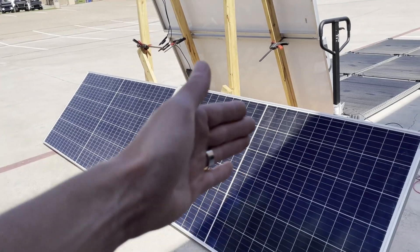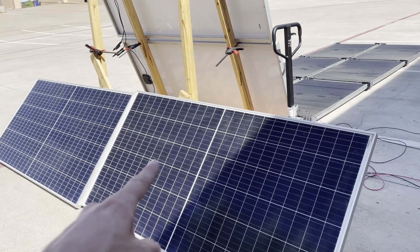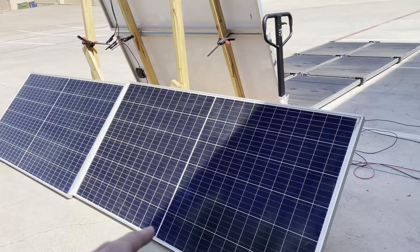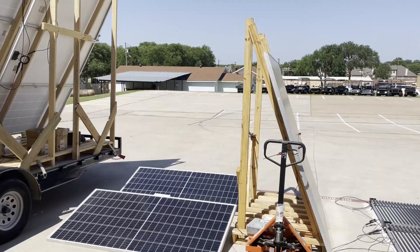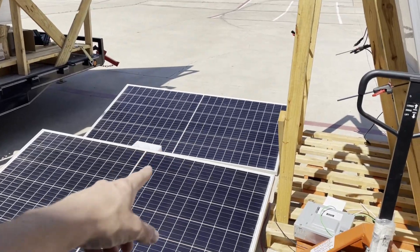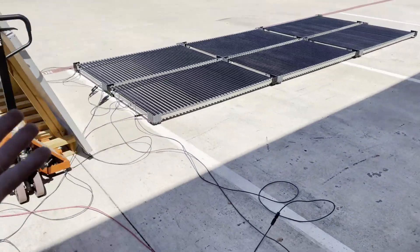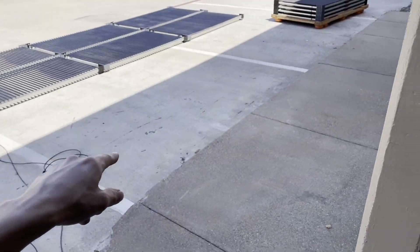These half-cells are coming into play, because only about half this panel has coverage, which means we're getting up to 400 potential watts or so. Once that clears up, we'll get just a little bit more. These guys are baking. I moved the panels around a little bit, really just to get them pointed more at the sun — did the stick-on-the-panel trick to see where the shadows are. These are supposed to be flat-mounted, so they're just flat-mounted. Just to recap: 790 watts there, 942 watts there.